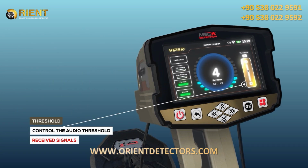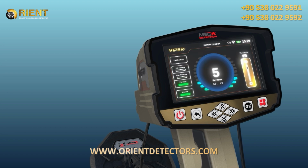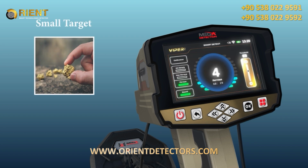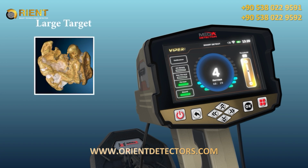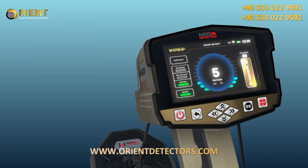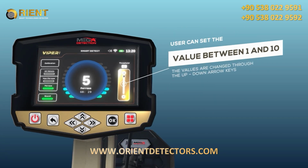Threshold. This option can control the audio threshold of the received signals, which can be set according to the user's preference, either to hear the faintest of faint signals coming from very small targets, or to ignore them, to focus on hearing the signals of larger targets. That is, the more we raise the value, the more unwanted signals coming from small targets are eliminated. The user can set the value between 1 and 10. The values are changed using the up-down arrow keys.